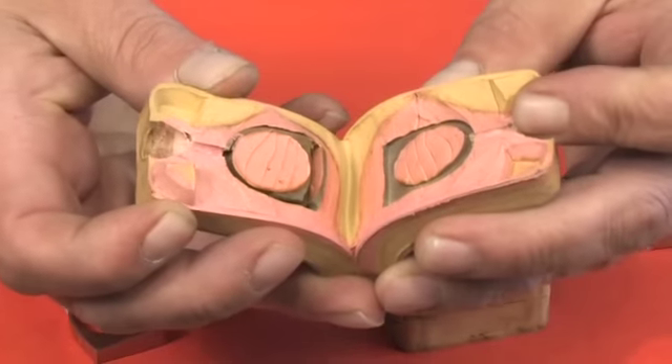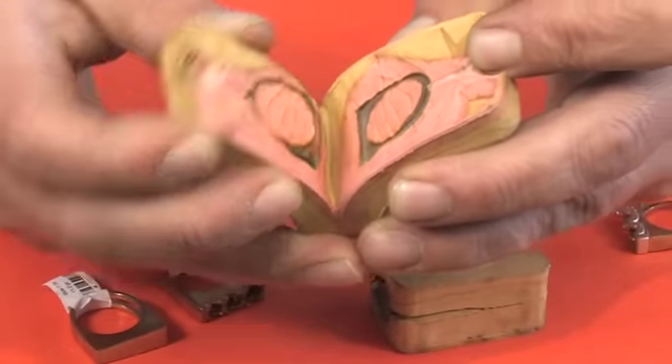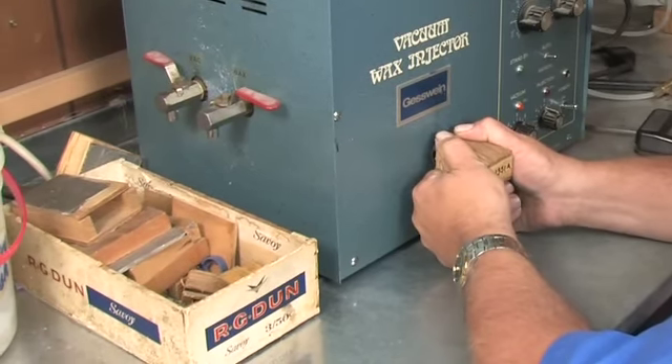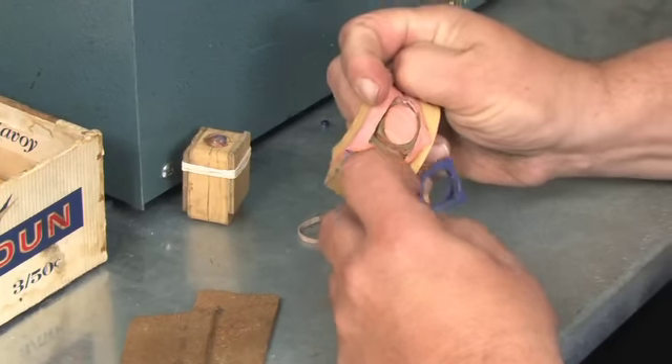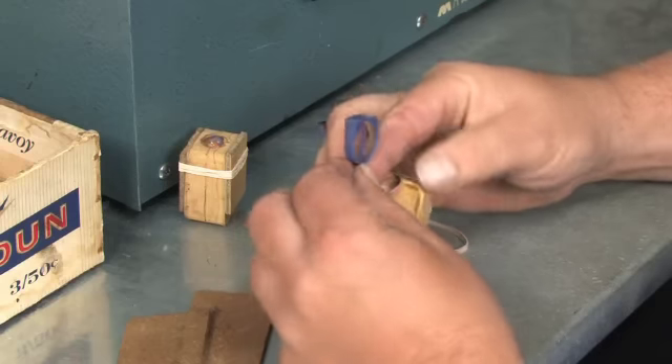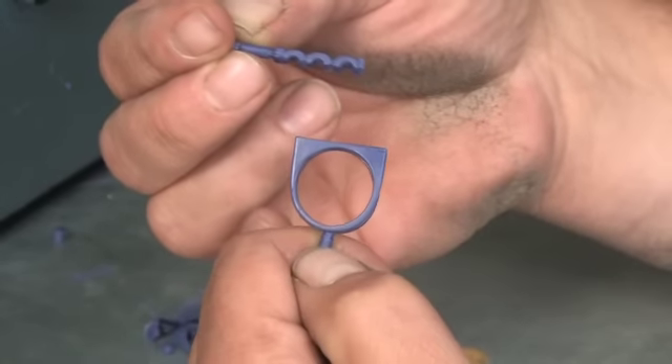And if you can think it up, we can make it. We make a rubber mold like this by vulcanizing rubber around the piece. Then we cut it back out and form this end here to be able to put on the nozzle of the wax injector. Then we'll take the wax from this rubber mold, size it to whatever size their ring finger is, and do any modifications that would need to be made to fit their stones to the wax.